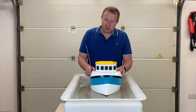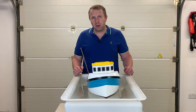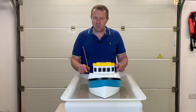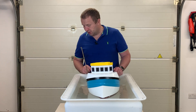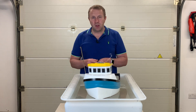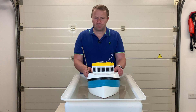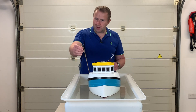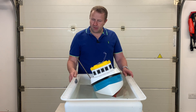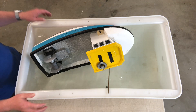A fishing boat needs adequate stability when it's at sea because she does a lot of lifting operations when she's in that condition. If the vessel stability is reduced — and I've reduced this vessel's stability just by adding a wee bit of top weight there — if I try and lift that same weight now, we could lose the boat.